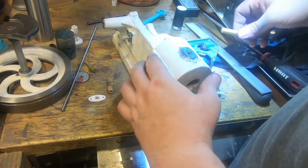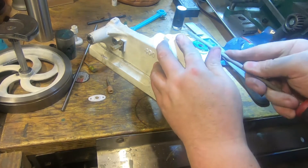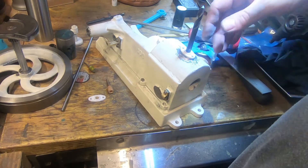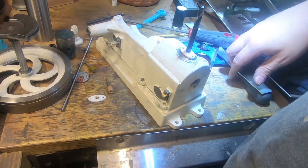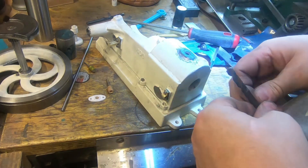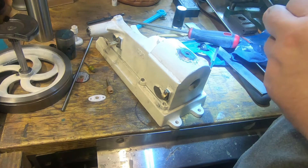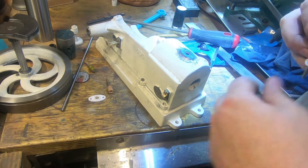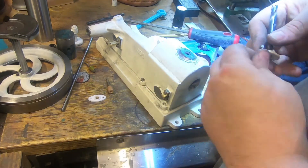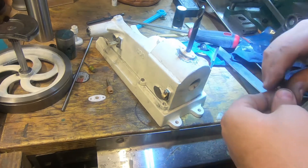As such this could probably do with a little bit more off this side. We were to carefully centre punch them and drill them to 6BA — I think we're going to go with 6BA again, which is the same as what we've done here. Actually they don't look too bad and they're a bit bigger than 6BA. They're actually the same as what we used here — actually looks pretty good. So I might drill it and tap and put two of them in there.